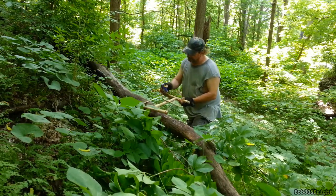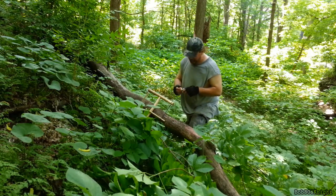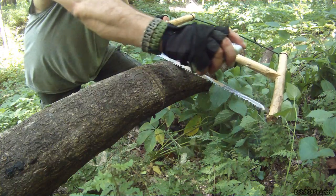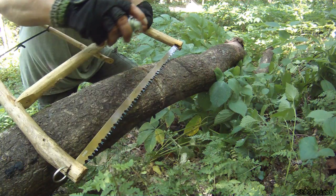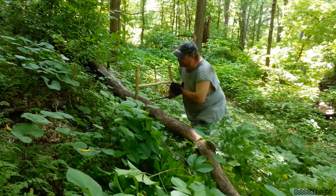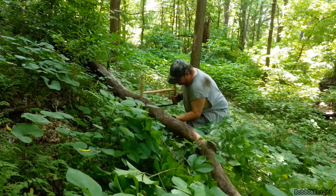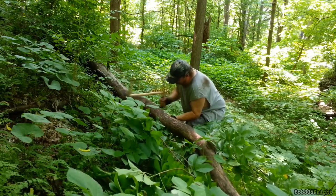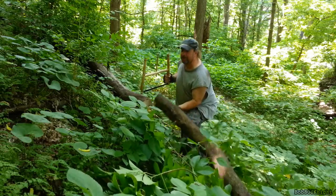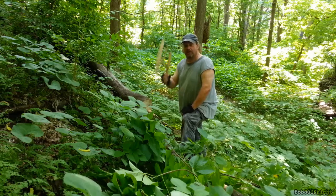Take a little bit of WD-40 and simply spray that on before you cut the wood, and then about halfway through go ahead and recoat the blade. It just makes it a little bit slicker and easier for the saw blade to go through the wood. There you have it — a very nice clean cut, and it prolongs the life of your blade.